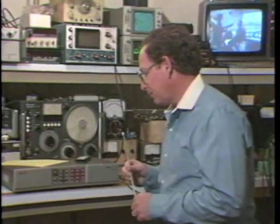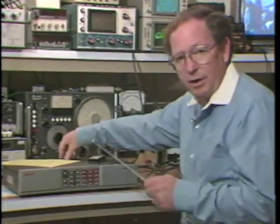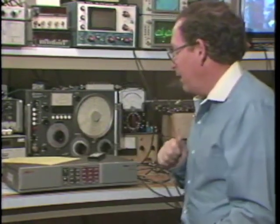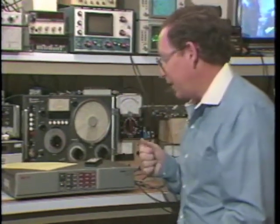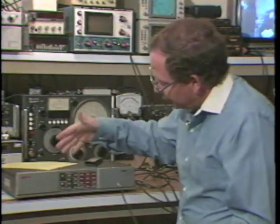I'll never know. There is an audio and level adjustment on the back for balancing the audio levels and the video levels between the VC2E and the satellite receiver. And that's very important to run through. You've got to have that and make sure it's set up properly or your audio jumps every time you change channels.